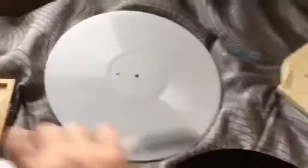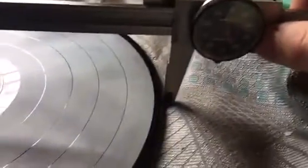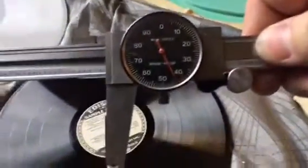Here we have the original disc, and we have the first copy that I've made. These are both on side R. And if we take a quick look using a dial caliper — bear with me for a moment — that is the measurement of side R. Then if we take a look at the copy: the copy is within five thousandths of an inch of the original. That's quite an achievement, considering a foot-long disc with only five thousandths difference. That probably puts it 99.999% the same.